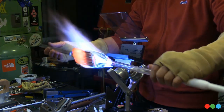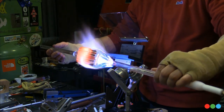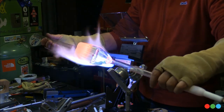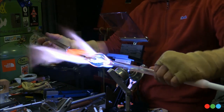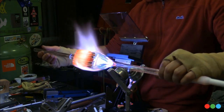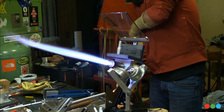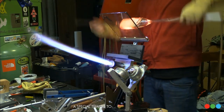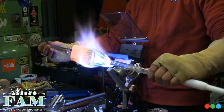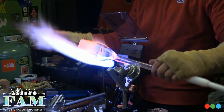So a pull like this, I would never do the other way. Same thing if you're shaping out a vessel: the time to switch to the other side is when it's getting further away from your dominant hand. As soon as you're working further away than you have to from your dominant hand, the difficulty level goes through the roof. The closer you can have the hand you sign your signature with, write with a paintbrush with, and stroke your girlfriend's hair with, the better. That hand needs to always be in charge of the glass, and if it's stuck on a roller, you kind of lose that advantage.